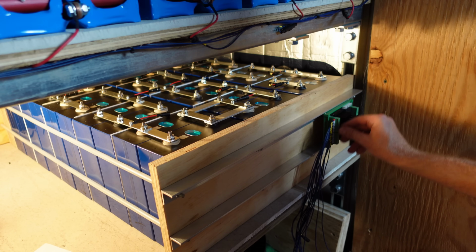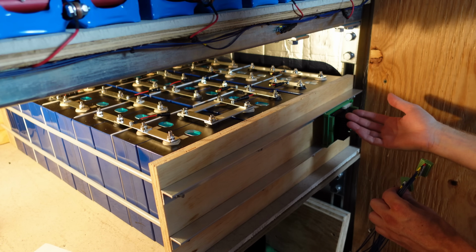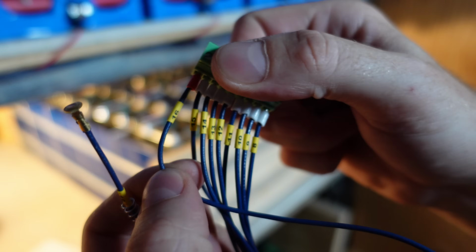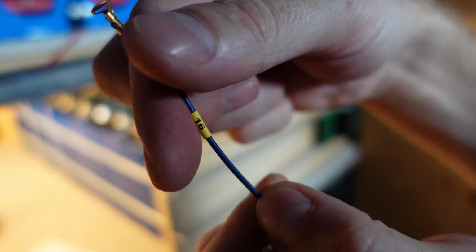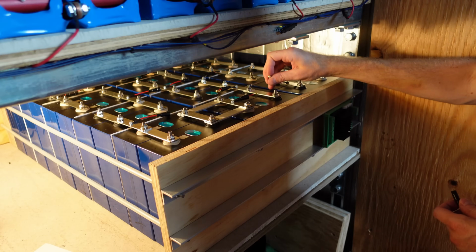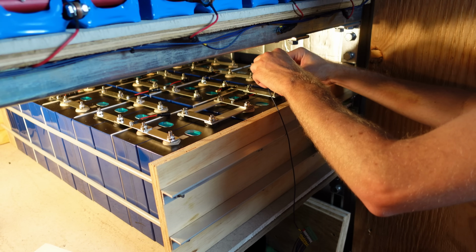While the K9 is more resilient to accidents than the Watchmon 5 and MM8, I'm still going to unplug these plugs for safety as I connect my fuses, because it's not completely immune to accidents and mistakes. So I'm going to take the wire labeled pin 16, verify the fuse end also says 16, and insert my fuse into the fuse holder and tighten it down.